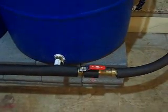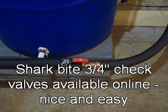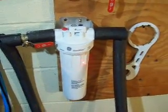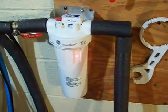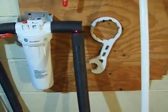So we're at the exit of our first barrel, and you see that I have the shut off valve, a check valve, then we go up this insulated pipe, a shut off valve right here, and then we go to the filter. This secondary filter is a 20 micron — this will keep any particulate out of your system, out of your pump. Don't run any dirt or contaminants through the pump.